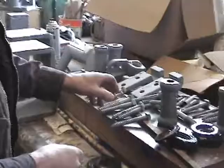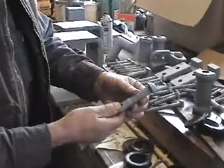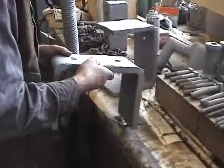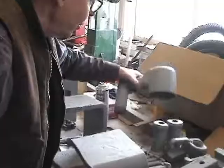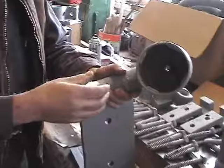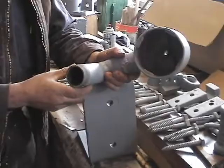These are all miscellaneous castings: parts for the bolster, pins for the brakes, and slide plates for a bolster. This is the air intake for the air compressor. It's filled with horse hair and there's a screen over it to keep things from pulling out. The air goes in here and into the air compressor. If you don't have a screen, it's going to suck in dirt, introducing grit to the piston rings and wearing the thing out.